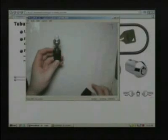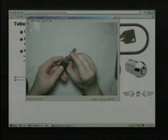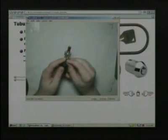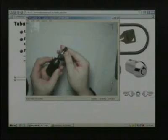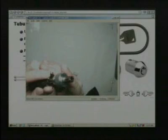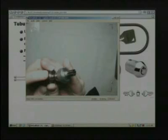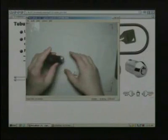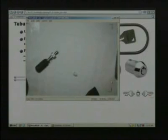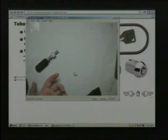If you have a pick, something like this is called a tubular pick. It's a really amazing piece of hardware, which has all these little fingers on the top that can simulate cut depths. You can simulate all different cut depths, whether shallow or deep. And working on that same principle they use with impressioning, if you just rock the pick back and forth, eventually the fingers will wear down and it should open.